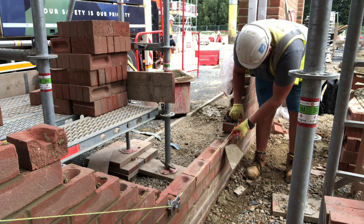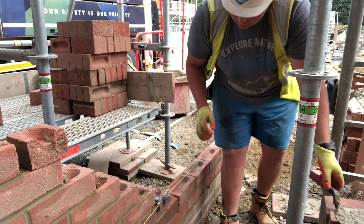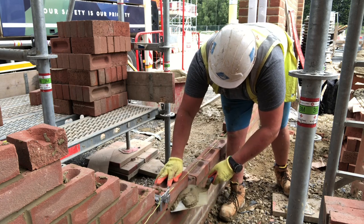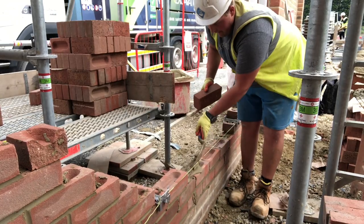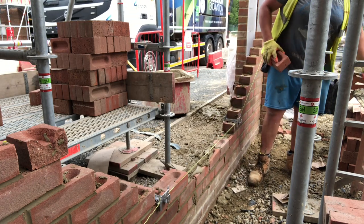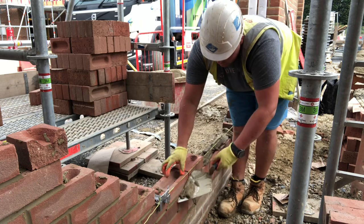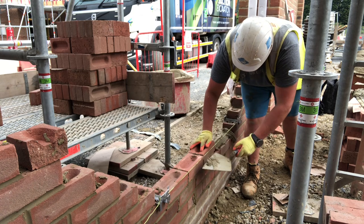When I come back on Monday, once I get the wall to full height I'm going to put a little bit of tile brick on edge — only about 400 mills, so about five bricks — and then get it to full height. That gives the renderer something to render around. Normally these walls would be done after rendering, but what tends to happen is your bond gets broken where the render sticks out 20–30 mills. You end up with a massive mastic joint at the bottom or a staggered broken bond part way up, so building the wall first lets them render around it and gives it a little bit of a cloak.